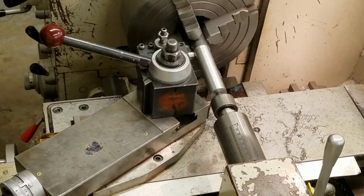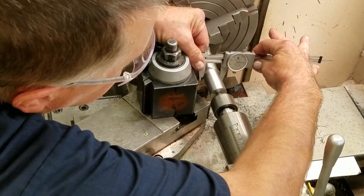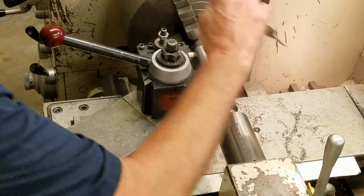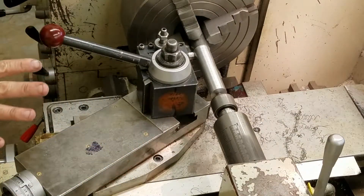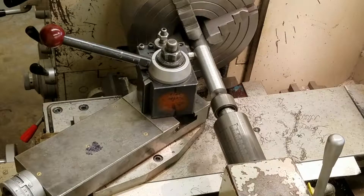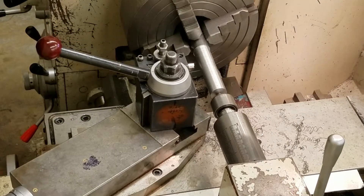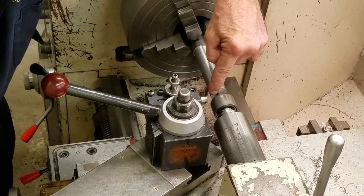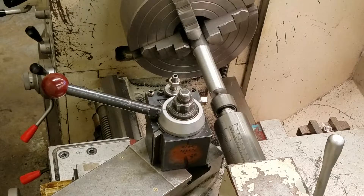Remember, if your part's a little hot it's going to be just a little bit big. You can see our diameter is 1.125 — that's exactly what we want. It took two passes: the first one was 61 to 62 thousandths, the second was 63. We're going to set our dial back to zero so we can always get back here, pull it back and take it back to home. Home position is when the tool bit is right between the center and the work. Now I want to show you how to get the length set.